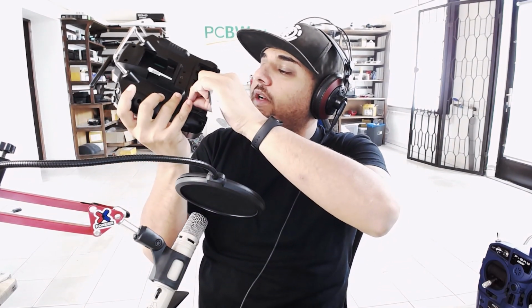So now I'm going to plug in a 2S LiPo here. That doesn't fit. Just keep that hanging. We're going to boot this guy just to make sure, because we're still not done yet. Welcome to OpenTX. Looks good. You're not going to have sounds, by the way, until we finish the SD card, which is next. You'll start getting this error here. We're going to take a closer look under the table over there. Right now, this camera's not great for this. But everything is booting up just fine now.